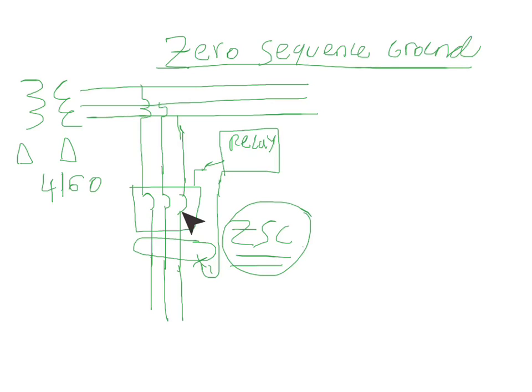Something we haven't talked about is the difference between low-voltage and medium-voltage systems. This is a medium-voltage system because of the voltage level — 4,160 volts. This relay sits outside of the breaker, and this breaker will typically be either a vacuum bottle breaker or, if you're in Europe, it might be SF6 in those bottles. It is not a standard low-voltage circuit breaker with mechanical contacts that simply open and close. It has contacts, but they're in a vacuum bottle in order to help extinguish the arc and break the flow of current — it is a different type of beast altogether.